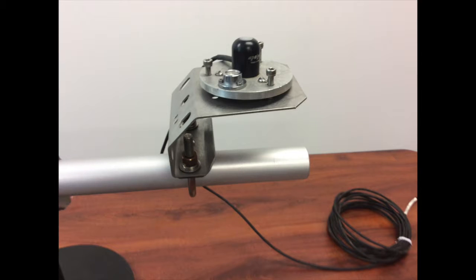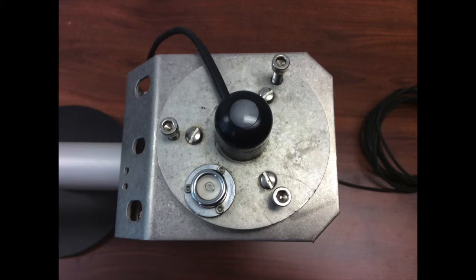Both sensors consist of a cast acrylic diffuser or filter, photodiode, and signal processing circuitry mounted in an anodized aluminum housing. Both sensors output an analog voltage that is directly proportional to either the total shortwave radiation (the SP110) or photosynthetic photon flux (the SQ110) under sunlight. The signal is directly proportional to radiation incident on a planar surface where the radiation emits from all angles of a hemisphere. This analog voltage is then multiplied by the calibration coefficient located on the sensor to report the radiation value.